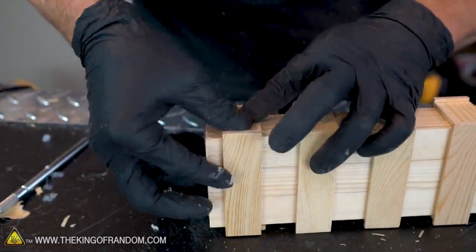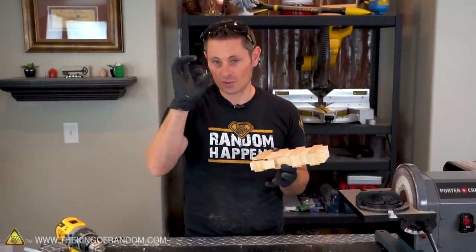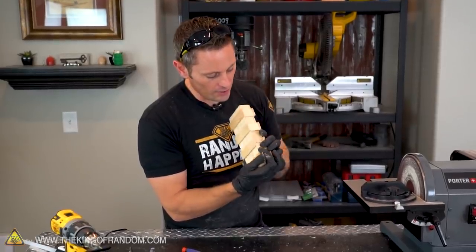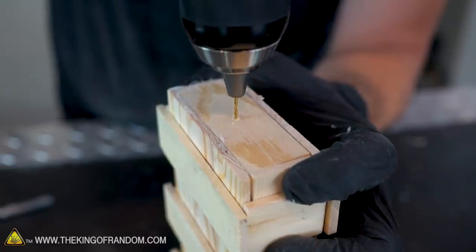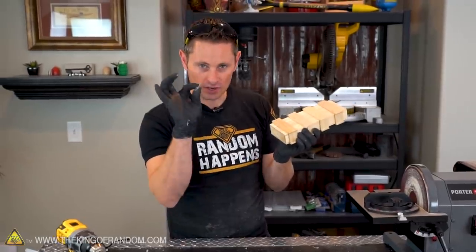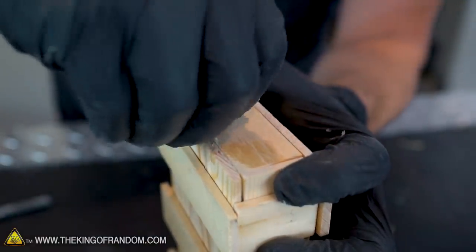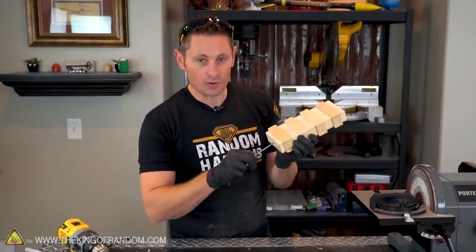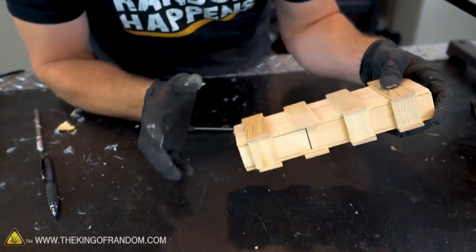The time has come to finish our box — that means adding the mechanisms that allow the mystery compartments to open. The first one starts with a small screw. Take the small drawer and press it all the way in, making sure it's balanced. When you feel like it's locked in place, drill a very small pilot hole in the back and center of the box to accommodate one of these small screws. Put in your screw and use a small precision screwdriver to tighten it all the way. That's going to go inside and grab the sidewall of that compartment so it doesn't push out — now it is locked in place.